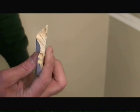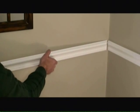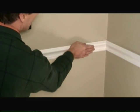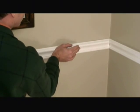Basically, I removed material from the back side. So now it should butt up into this corner and over the original piece of molding that I installed, and look fairly well snug and tight. As you can see there, that's nice and clean. Just a little caulk or wood filler and that seam will never be noticeable.